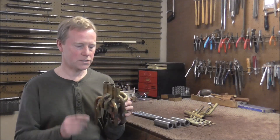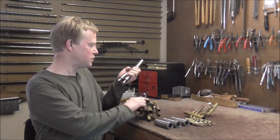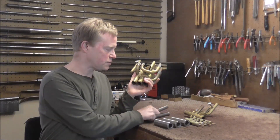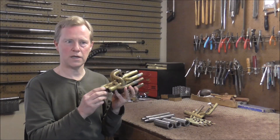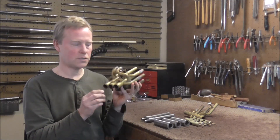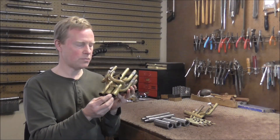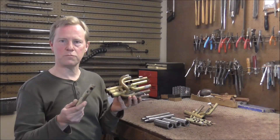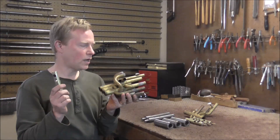The other parts in this job are the casings. The casings are not cylindrical either — they have worn very unevenly. I have two valve casing mandrills: an .871 and an .869. What I'm going to do is put the casing mandrills in the casings and wear the metal down inside the casings on the high spots to make them more cylindrical. So I'm going to end up with a slightly larger casing, then a smaller valve, leaving probably about six thousandths of an inch of metal that needs to be added to the valve, and I have to figure that out too.